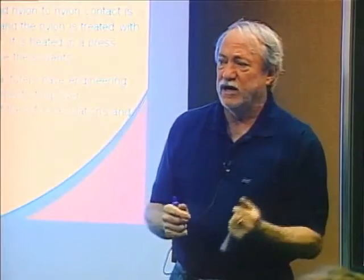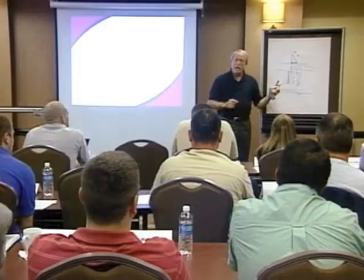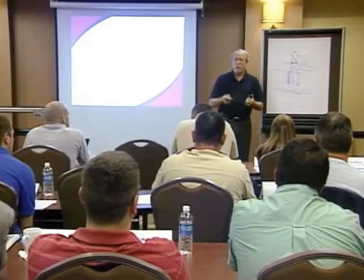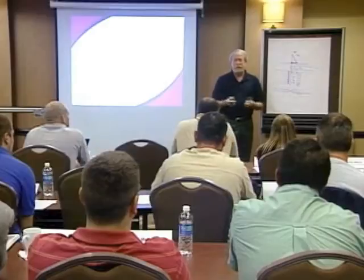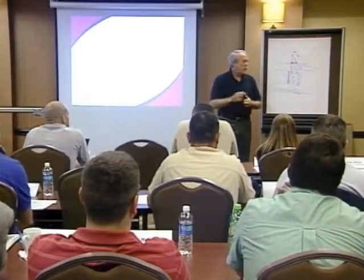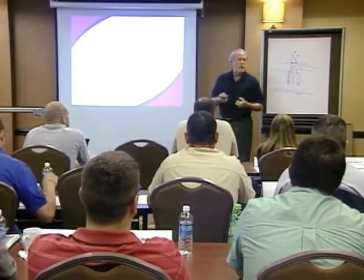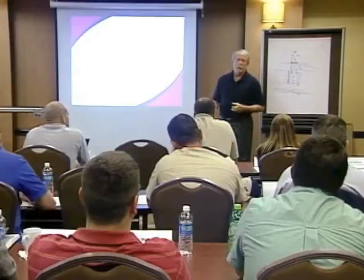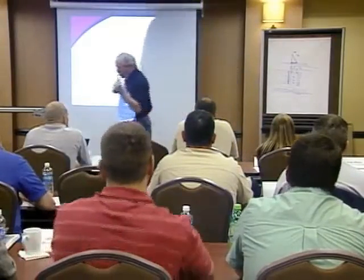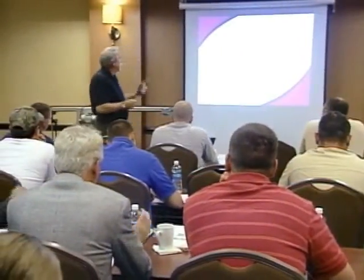Nylon core splices can be amazingly strong. A nylon core splice, when done properly, can exceed the breaking strength of the belt itself. It can go up to 100, 110%, maybe even a little bit more when it's done properly. So nylon core is very, very strong. That's why they use it. That was the old-fashioned way of transmitting power way back before V-belts and things like that. So nylon core is very strong, very forgiving on shock loads.